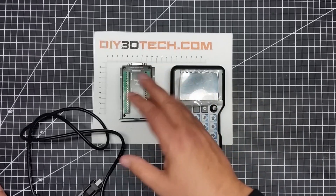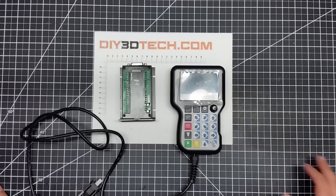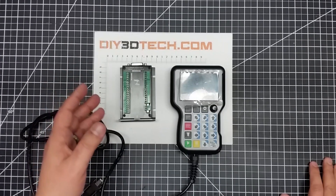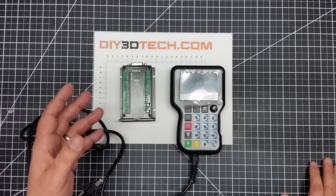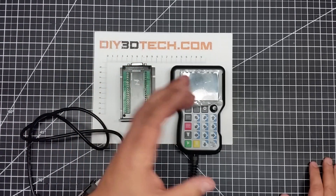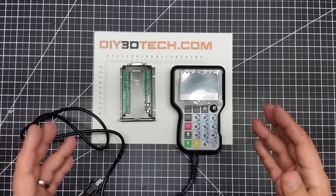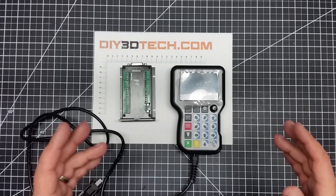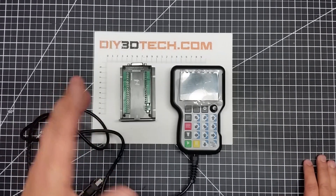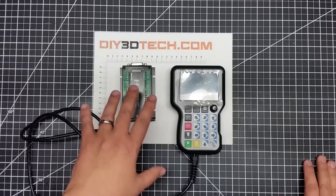My goal is to take this and wire it into the existing stepper drivers of the 3040 machine I have, just like I did with Grbl. I did an episode — actually probably a couple — where I set up Grbl on an Arduino to interface with the parallel port to act as my communication mechanism with the 3040 CNC, which worked out very well. My main issues with Grbl have been the USB connection from the sender to the Arduino itself — that's where a lot of my signal losses come in. The cheap Chinese UART that a lot of clone Arduinos use is the culprit. My recommendation is to use a full-fledged Arduino. But I also want to do four axis, and this gives me the ability to do true four axis without swapping the X.